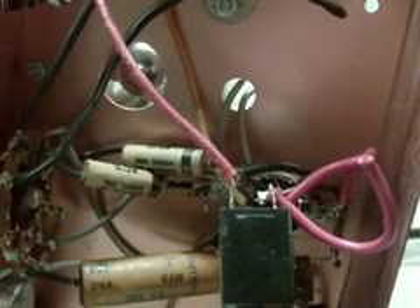I will clip lead in resistor values to get the voltage to where it needs to be. I'm figuring if I can get it down to around 120 on B+, that should be fine — that'll be in tolerance. It's supposed to be 110, but if I can get it down to around 120 that should work fine.